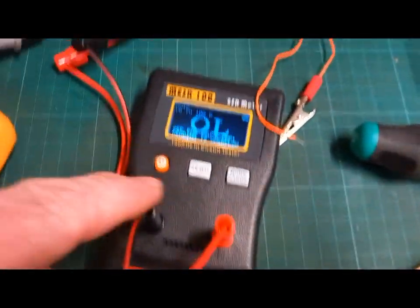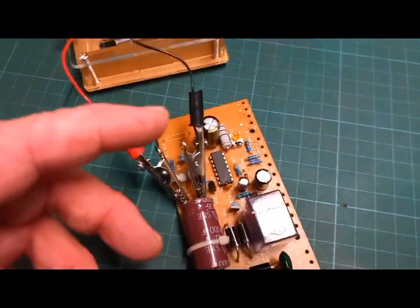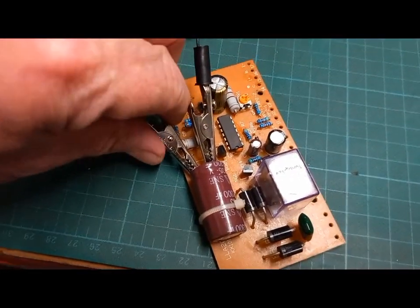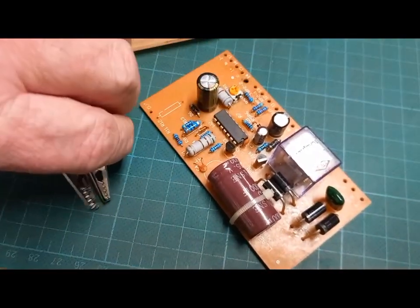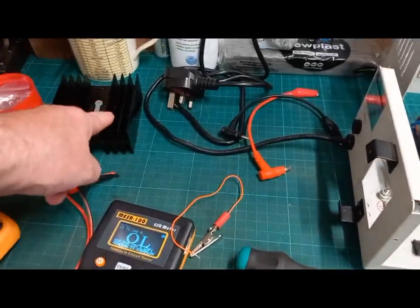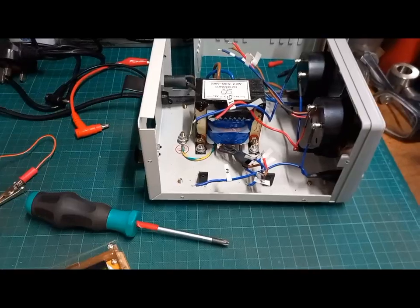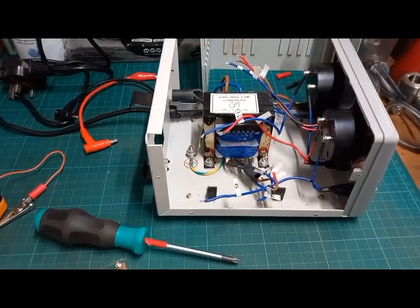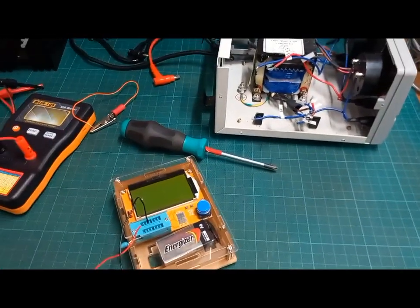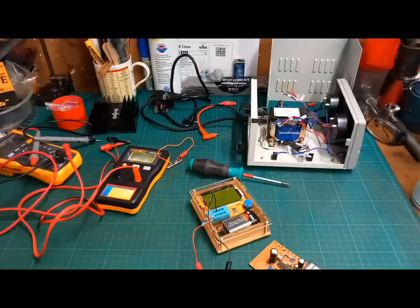The other way to test ESR is with this little meter, but again it sometimes works and sometimes doesn't when in-circuit. The only real way is to desolder and take them out, but with this board falling apart when you desolder things, it's easiest to just stick it back together when we get the new transistor and see if it works. I'll probably also check the transformer windings — megger them out and see if everything looks okay there. I'll come back to this one when I get the parts. Thanks for watching this slightly different video — bye for now folks.